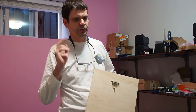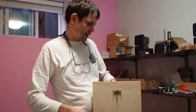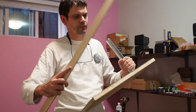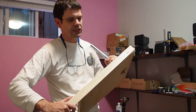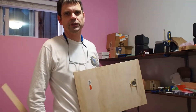Now I've got two problems to fix. First, we've got these bolts which can't go on the table, so I need feet. And another problem is that this stainless steel has a very sharp edge. So I'm going to solve two problems in one go by mounting wood on the side — so I don't cut myself on the steel, and it gives some spacing for the bolts.